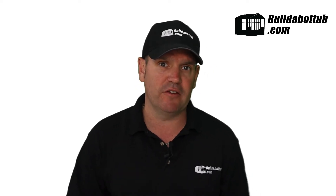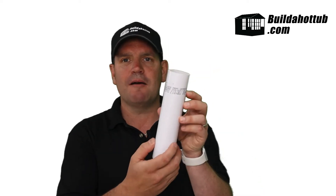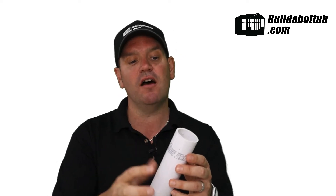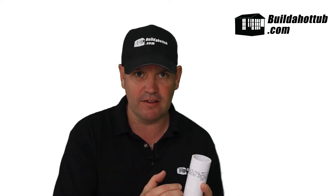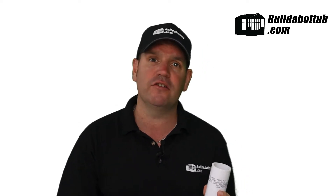What rating of pipe should we be using? We need pressure-rated pipe — around the 100 PSI mark is pretty standard. You can tell on the pipe itself as it's generally marked. Here I have a piece of one and a half inch pipe rated to 65 PSI — anything from around 50 PSI upwards is totally fine. On the airlines there's less pressure than on the water lines, but you must use pressure-rated pipe, not drainage pipe. This must be pressure rated.